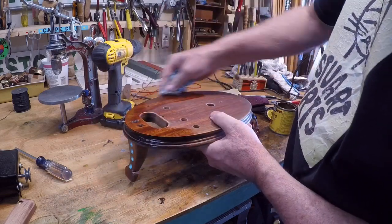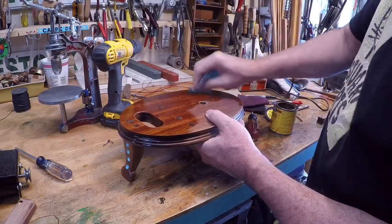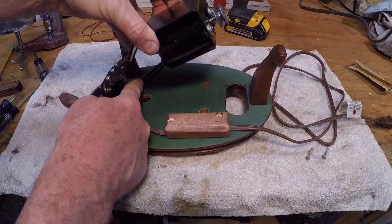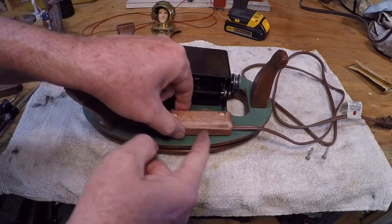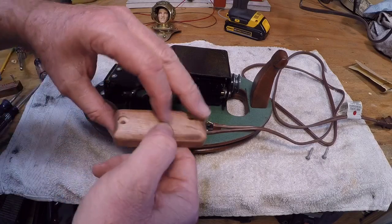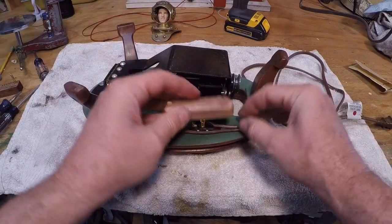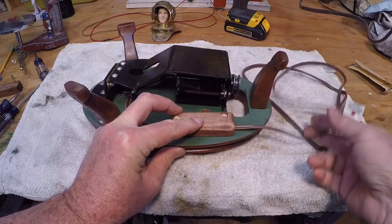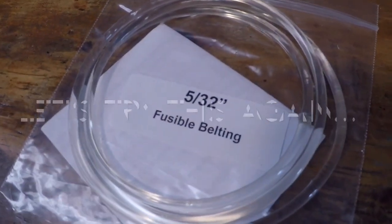The carpentry is done, so I'm putting a little bit of stain on it and probably a little paste wax to pretty it up. When this dries I've got the wiring coming around from the leads I soldered on — the wires go into this little box that I made. There's a toggle switch in there and it stands proud off the bottom, so I had to make a little cover that's coped out. It'll fit over the top and down tightly on the incoming and outgoing wires, and a couple of screws will hold it flush to provide strain relief for the cord. They said 10 days on shipping — I had it inside of 48 hours.